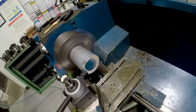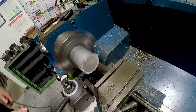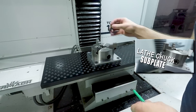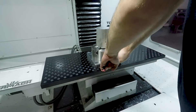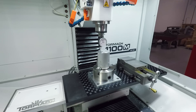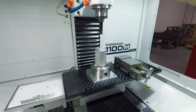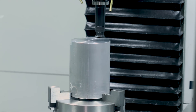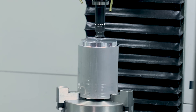Now we don't have much extra stock at all to work with in the OD of this round bar, so I trued up these saw cut faces on the lathe real quick to give us a better reference for Op 1, which we're doing in a three-jaw chuck mounted to the subplate that you should have seen us make in a previous widget. I'm roughing out with a one-inch modular shear hog on a medium-length body using a both-ways 3D adaptive strategy from Fusion.